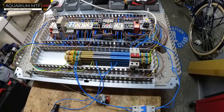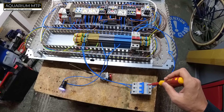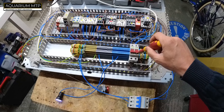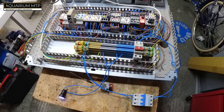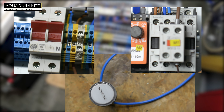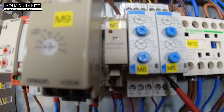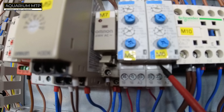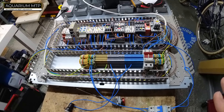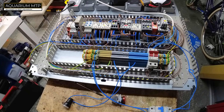Now let's see what happens when mains power comes back on. The generator is still running, still producing 230 volts into our system. We're going to bring the mains back on. Our aquarium is still working... I'm pressing that on now... and the aquarium is gone. The other timer will keep flashing to signal disconnection of the generator. At this point there's no power supply to the aquarium until the generator goes off.